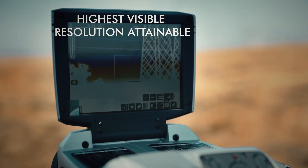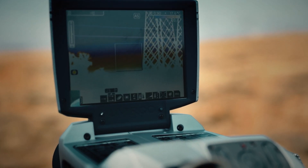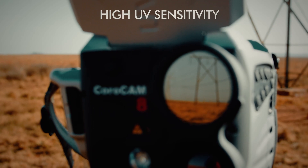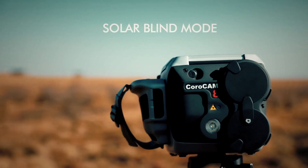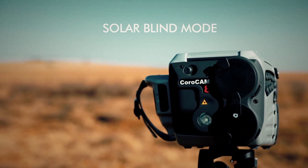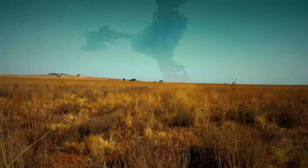The high-resolving power and optical zoom of the visible camera makes pinpointing the cause of a discharge a cinch. The high sensitivity of the UV camera enables the detection of corona at practical distances even in daylight conditions, thanks to our solar blind mode. The non-solar blind mode increases sensitivity for use in conditions where there is low background UV.